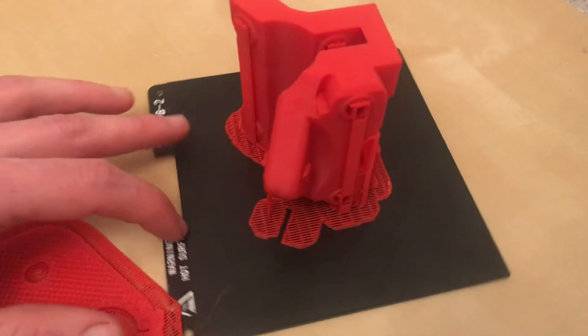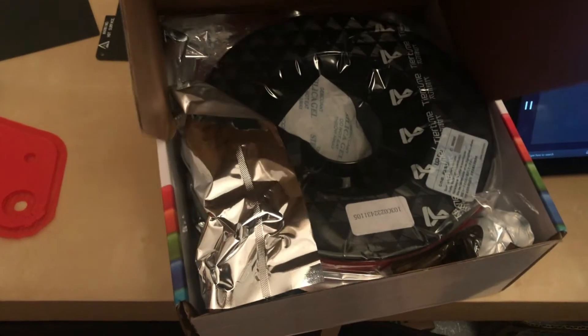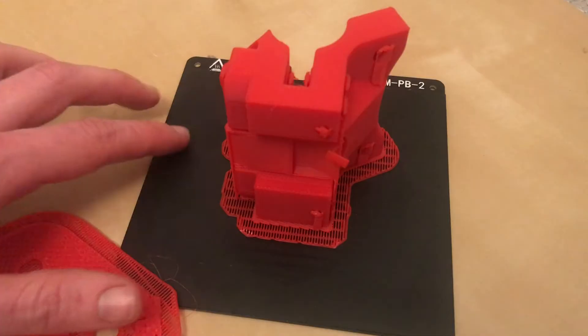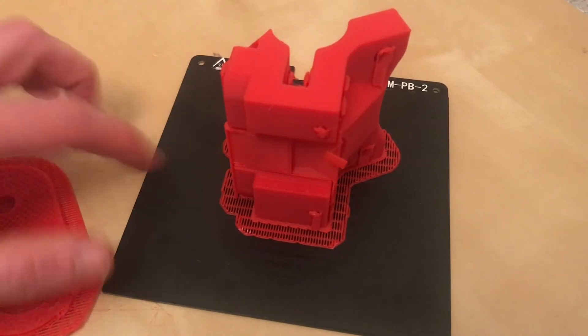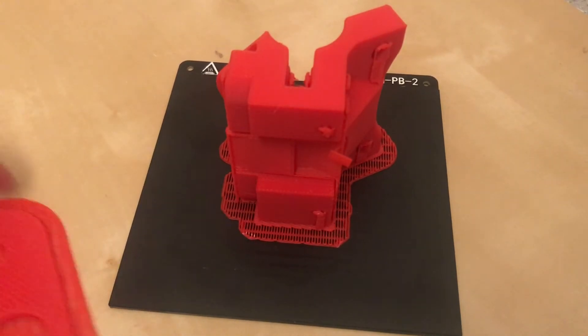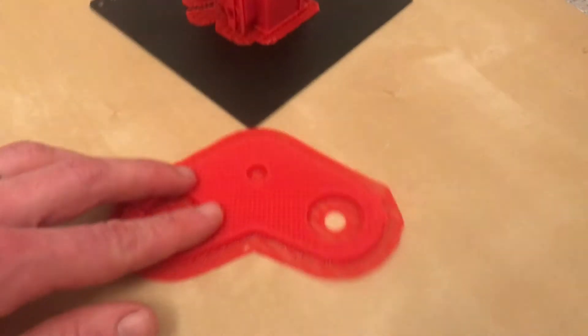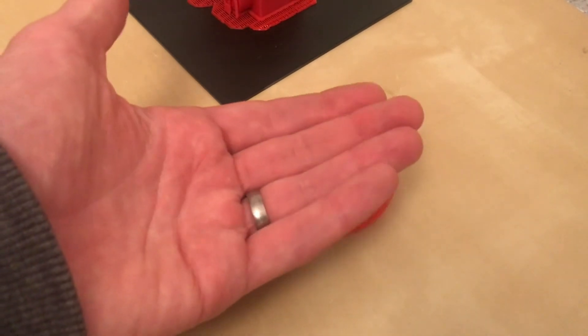The UP Mini 2, as good a printer as it is, it doesn't have a massive print area and I suspect that if I were to get a thermal imaging probe on the bed I'd get temperature variations further out to the side, so the closer to the edge the more difficult it is to stick to the bed. And not only that, the longer a part, the greater the thermal gradient across it and the more likely it is to bend up.